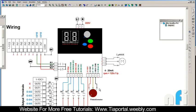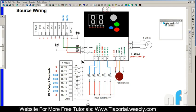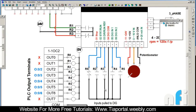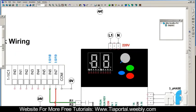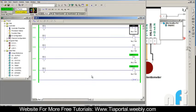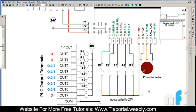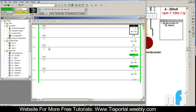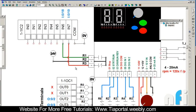The drive is connected to the motor via U, V, W pins for three phase. This is how we have wired the drive: the PLC reads the feedback and PLC outputs turn on the inputs in source wiring mode. For sink wiring, the only difference is that instead of 24 volts, the digital common is connected - common goes to the control terminals internally and 24 volts is not connected there. It's not necessary to use a PLC; you can use simple toggle switches or NC switches. But to make this course more practical and complex, I've used a PLC - MicroLogix 1400 - to control the drive and practice PLC ladder logic.